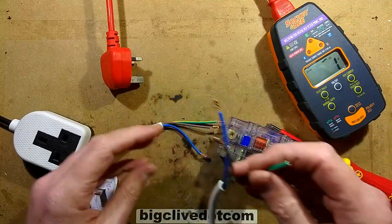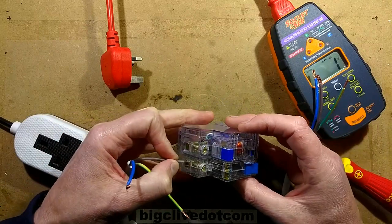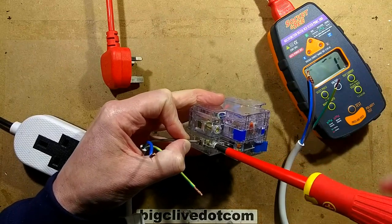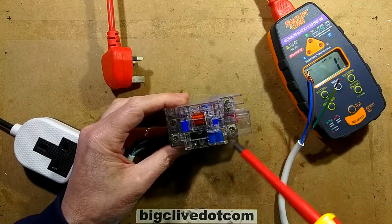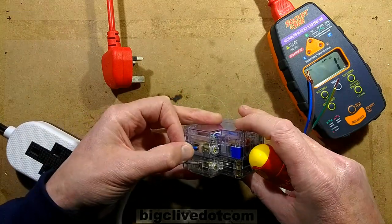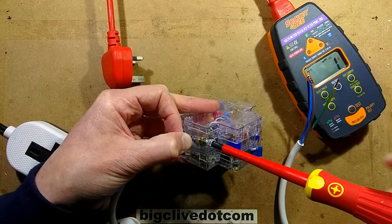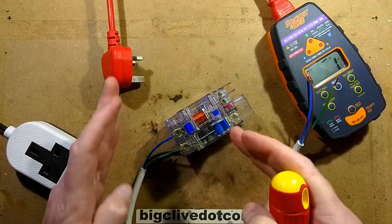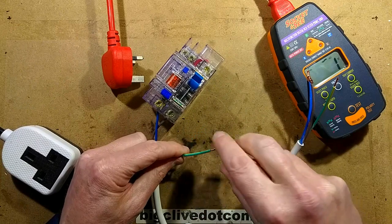Let's test this by wiring in the live through the circuit breaker itself. Initially the current flows through the actual circuit breaker, which is just an ordinary circuit breaker stuck in the side of the trip mechanism. Then it comes out the circuit breaker, goes back up, and goes through the sense circuitry. The neutral goes in here, and Earth just bypasses this completely, because it only needs to monitor live and neutral to detect the fault — it's basically measuring the current flowing along live and back through neutral, and if it sees a difference it knows something has leaked somewhere.